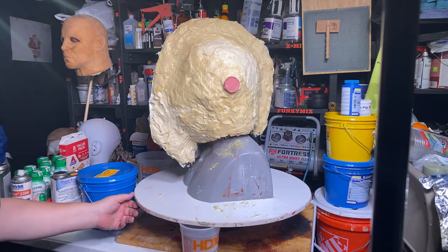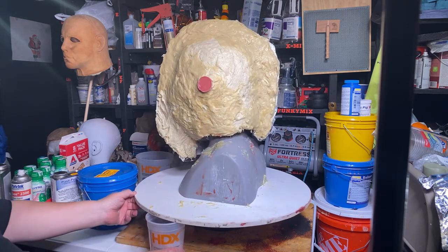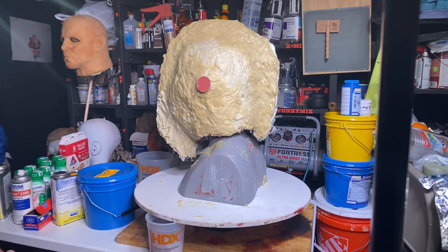And that's going to give me a really good, strong mold. Then I'll come back tonight, or I might have to wait till tomorrow. I have to look at the cure time on this resin. I definitely want to make sure it's at full strength, because if it's not, it can crack real easy. I think I have to wait till tomorrow. I need 24 hours to let that really harden up. Can't rush this, you really can't. Are you kidding me? Two years of work? Now's not the time to get impatient.